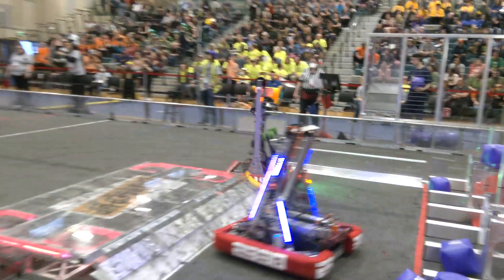You said you started out with one vacuum motor a couple weeks ago — you won an event two weeks ago — so what made you want to change to put on more? Our reasoning behind it was: if we only had one vacuum motor, what happened was if one suction cup didn't quite seal, we wouldn't end up with the game piece sticking. So we went to three independent lines as well as three independent vacuum motors. We started with one vacuum motor driving all three, and eventually down here we changed to three Neo 550s, all of which are powering independent vacuum lines which come up and power our arm holding the game piece. This has worked with both game pieces for every match that we've had it set for.